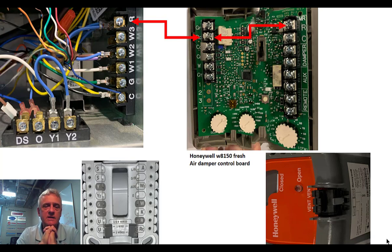If you don't agree with that and simply want a second transformer, don't have that jumper from RC to R — don't put it in. Just wire a transformer to RNC on the right-hand side on the fresh air board. But for this PowerPoint, we're going to take you through how to power your fresh air system off of your main transformer. For just about every situation out there, it's not going to cause you a problem. If you're popping fuses, there's something mechanically wrong — a relay, a contactor, reversing solenoid, or maybe even the damper motor's got a problem. Typically, the regular transformers can handle it.